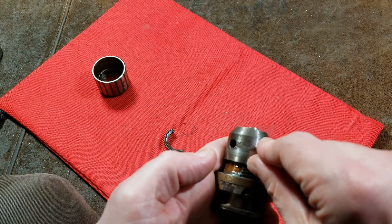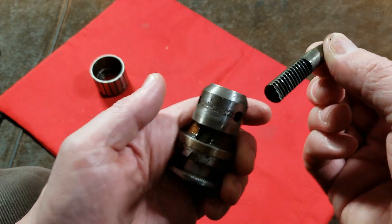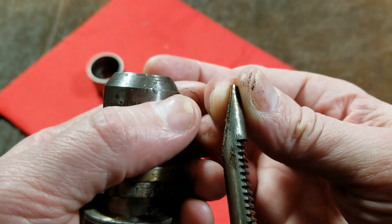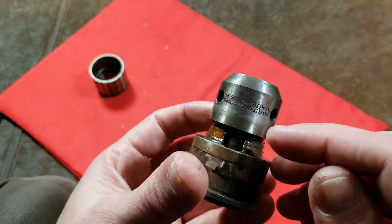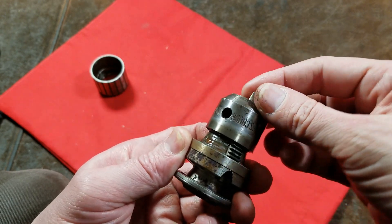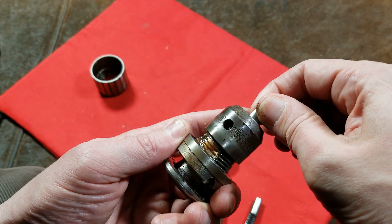At this point all you have to do is use your finger to pull them out. Sometimes these get really stuck so you might have to hammer through there. The beauty is they have a precisely drilled hole and these special teeth that ride up and down the ramps — that's why the face is angled the way it is. It's not totally critical that the teeth end up in the same bore they came out of, though you usually want to keep it that way. The only critical thing is keeping them in the correct order so they expand and retract evenly.